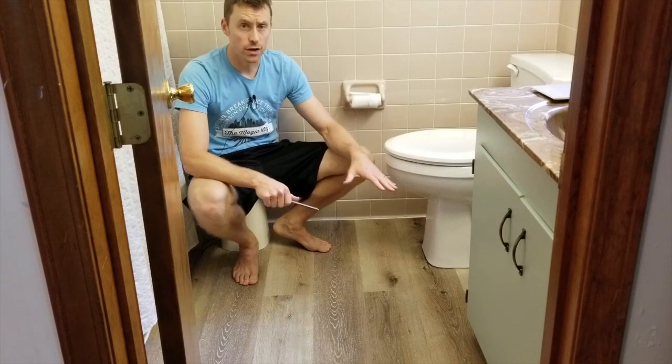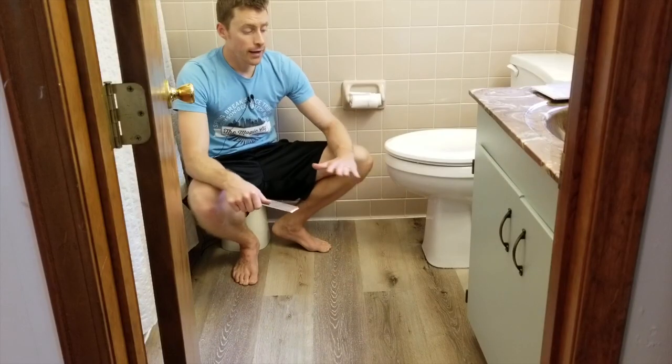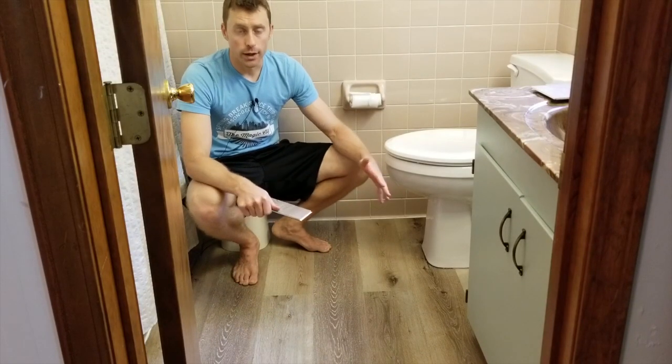You do have to put an underlay on your wood subfloor. I used the CaliComplete product — it looks like foil and it's pretty thin. You lay that out first, and then you install your floor floating over top.